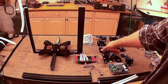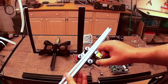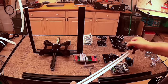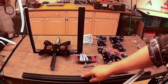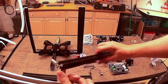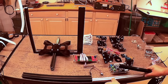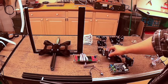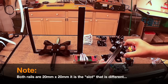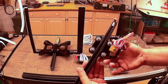The problem with these V-slots is you can't tighten it up because the grooves are far deeper with regards to the way the maker rails that come with it are set up — because these are not V-slotted, they're just a straight slot. The wheels run inside like this, and notice how tight this is going on there. So this is the problem.